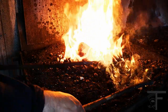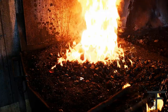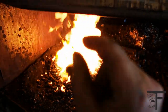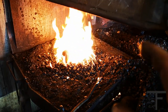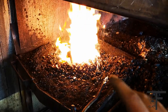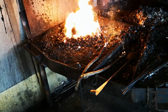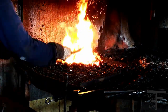So that the brass will float around on the inside. At one point it will start to come a little blue flame, and that blue flame is an indicator that the zinc is going out of the brass, and then hopefully it is done. So I think I will take the camera now and move it a little back. Bad for business, destroying two cameras.